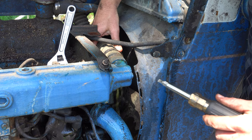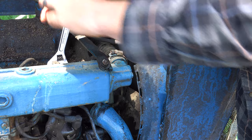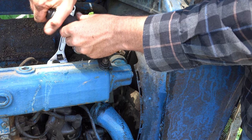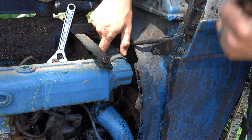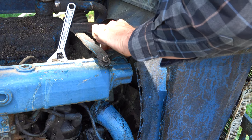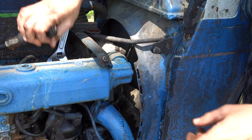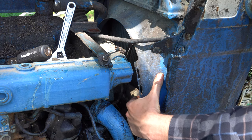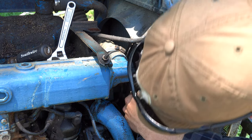I am not seeing a leak in that hose. I'll see if I can get it to stop leaking by tightening this down. There's a chance that just by this fan blade being able to hit that, I was causing this to loosen up — and I have a feeling that's where my leak came from. But my bigger question and larger concern is why is this even able to move? It doesn't seem like it should be able to move the way it is. I'll get down in there and look.